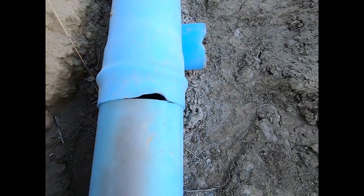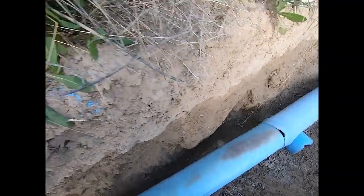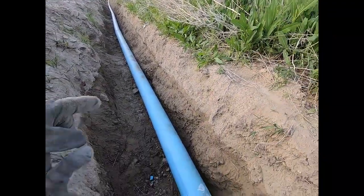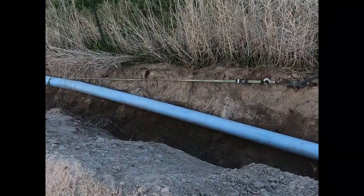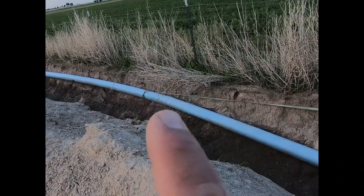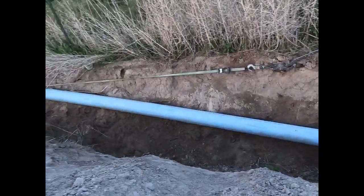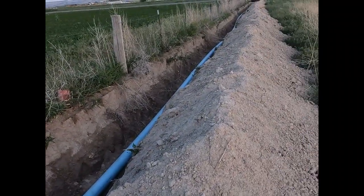Well, now that I kind of have the pipe started here, going together on this end, I'll save you the time of watching me walk back and forth way down yonder to where the ratchet strap and the come along is to move this pipe up this way and get it stuffed in there about 5-6 inches. Now, in case you missed why I had the ratchet strap anchored there on the left side of that joint and running all the way down here to the fence post right there, is because I wanted to get all of those joints from there all the way down squished back together.